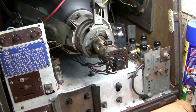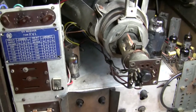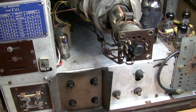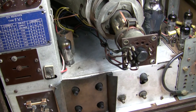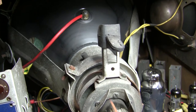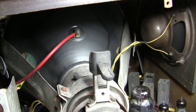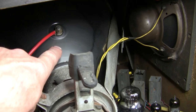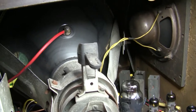In this quick update video, I've had the chassis out and given it a good de-dust and clean — it's certainly looking a lot better. I have even started to change some capacitors, but more on that a little bit later. I've wiped all the sooty mess, and the tube area will come out for a good clean if the set is further restorable. I've cleaned around where the EHT goes into the tube, because as I'm sure all you television buffs know, you can get some arcing there.